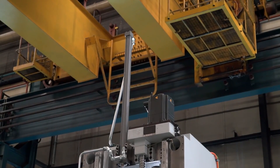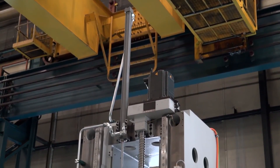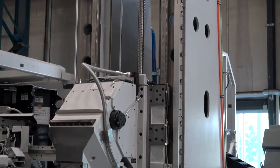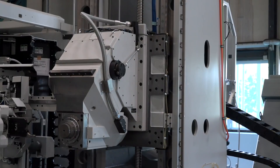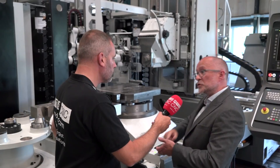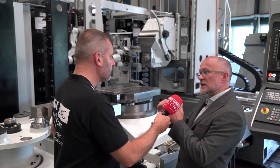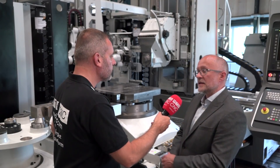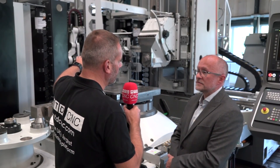You've got a cylinder on top of the Y-axis — what's that for? You've got very heavy-duty twin ball screws in the Z-axis and a single ball screw in Y. What the cylinder does — it's a hydraulic cylinder that takes all the weight off the spindle group. An HV head is quite a heavy spindle group, and if you're doing an orbit you don't want a crossover where your X and Y axes run from a plus to a minus. That cylinder eliminates that potential problem.